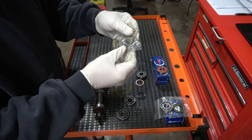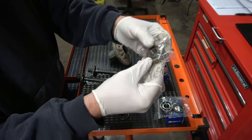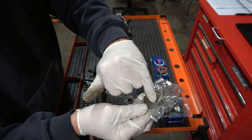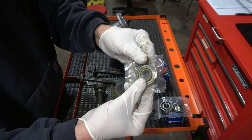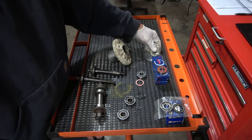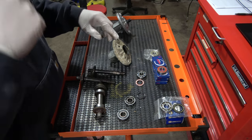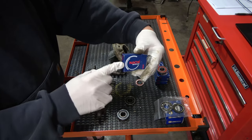And then another one I'm going to test is this roller bearing — it has pins. The problem is the bearing will kind of just pop out of the bag, so when I install it I need to make sure I put it in correctly. You can see this has space for grease to go around, and it's also open on both sides, so it's designed to be greased. There's no grease on it at the moment. It was expensive, which is why I only got one. If I upgrade them I'll try to get more, but I need to buy them at a cheaper price. These Japanese ball bearings were not too terribly expensive — about the same price if you get a bunch of them on Amazon.